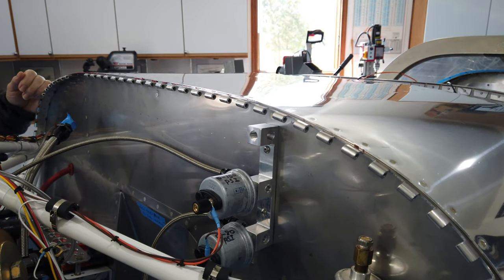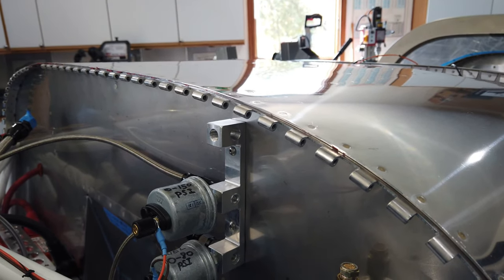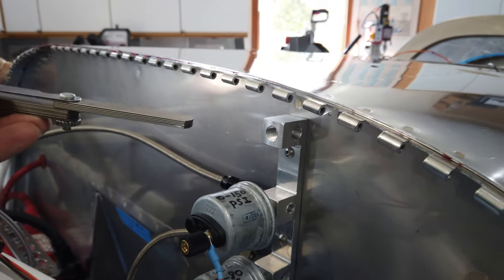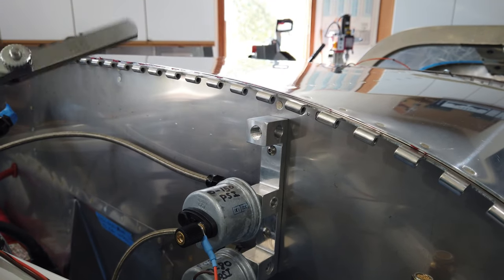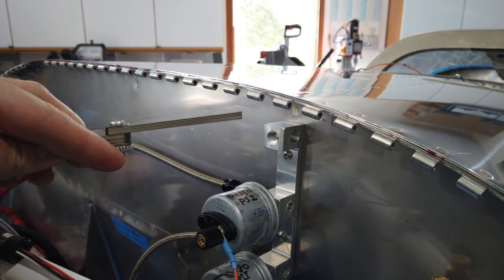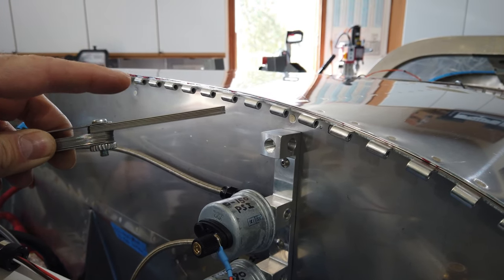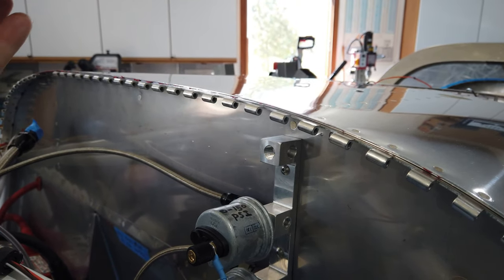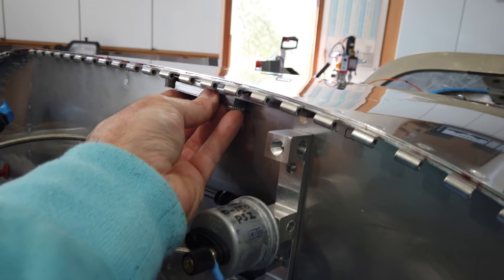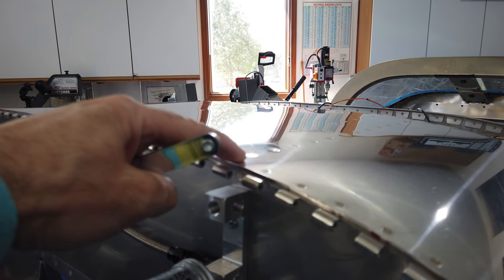I got that rivet set and it came out really, really nice, just like the other ones I've done with this method. Again, I just use a set of feeler gauges - you can see this feeler gauge: this is the rivet end, this down here is the nut end. You can see there's not a lot of space between the rivet and the feeler gauges, and that's what you want, because this stack-up then sits in here behind the knuckles of the hinge itself. This is the rivet I had just done - it's directly over this manifold and there's a knuckle between the two.